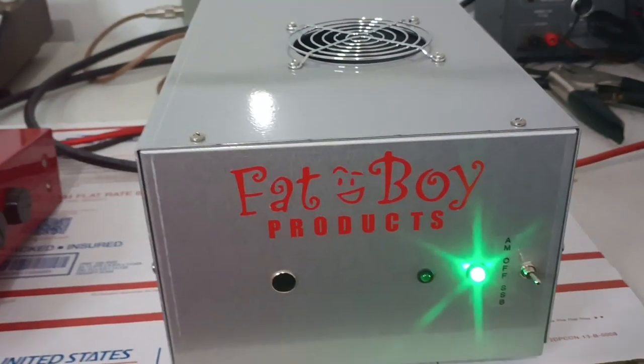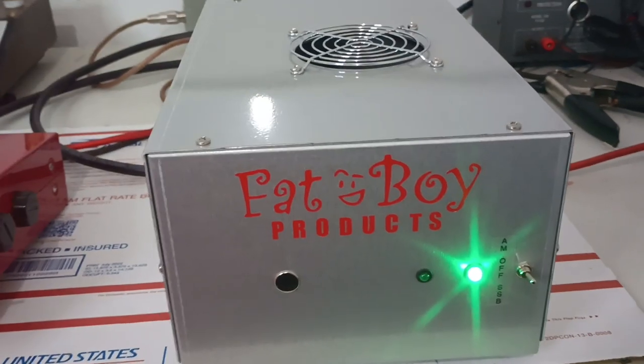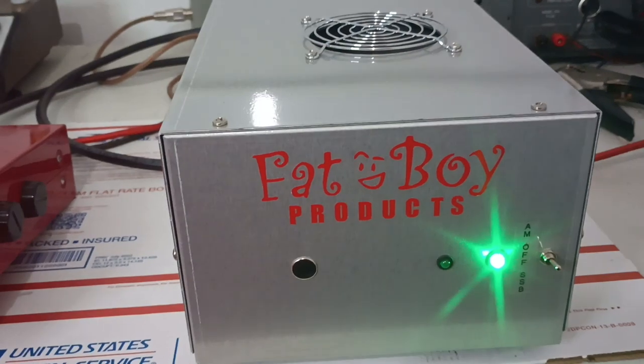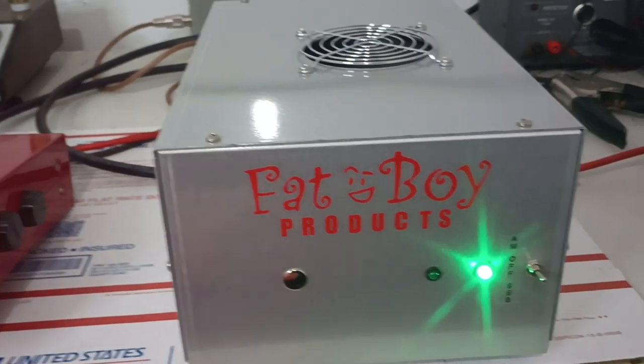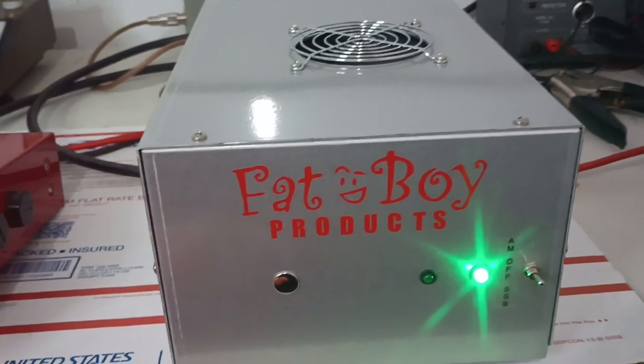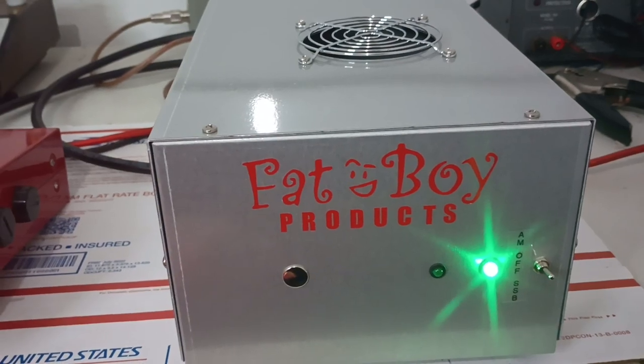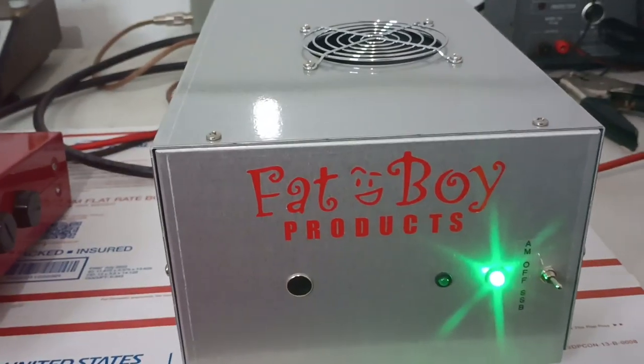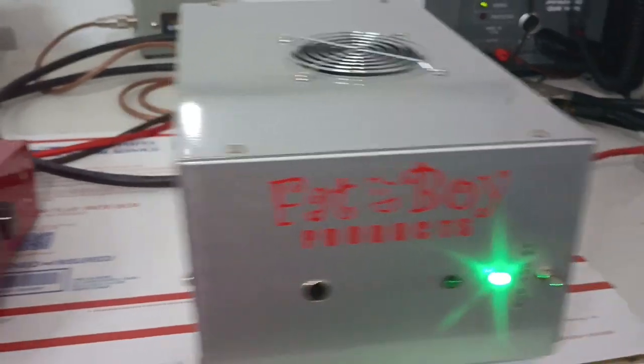These remind me of the old Palomar 500 bass amps. If you could get a real hot one, a real stout one, they would usually do 500 or 600 watts PEP if they had a good power supply in them and had 1446s in them. But that's kind of what the 454 transistor reminds me of. Super nice little amp here.